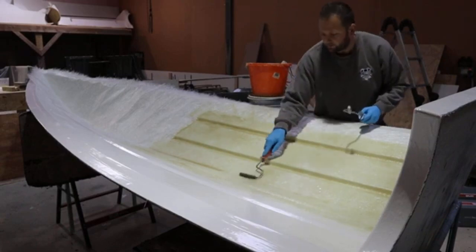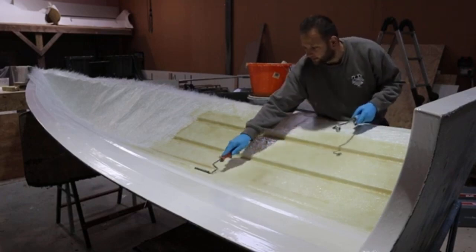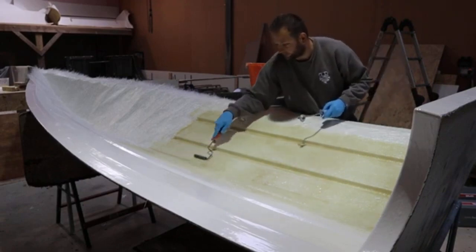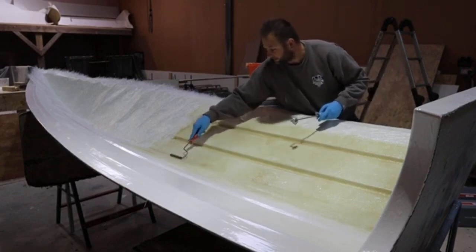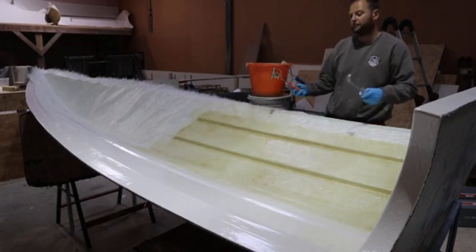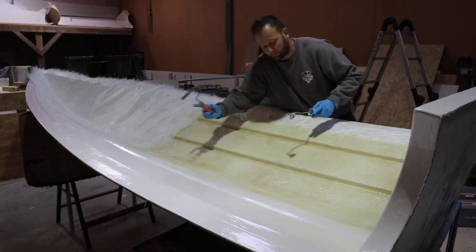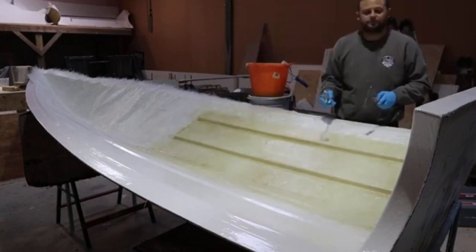So really, from your standpoint, if you're ever doing a repair or you're making a little sink mold or you've built a mold out of melamine that you want to lay up, then try and catalyse at 2%, okay? So if you're not good at maths, well, not that there's ever an issue with that, it's just to try and make it a bit easier for you. So I'll weigh everything in kilos, okay? Kilos, 1 kilo, 2 kilo, sort of maximum of 10 kilos. And I'll probably not suggest doing 10 kilos yourself at one time, unless you're pretty bang on with what you can do, okay? So let's take, for example, 1 kilo.